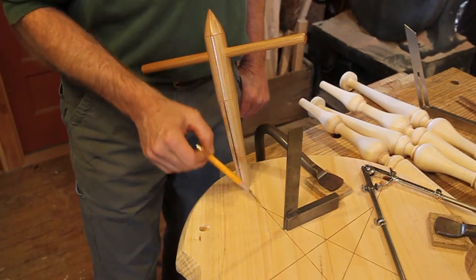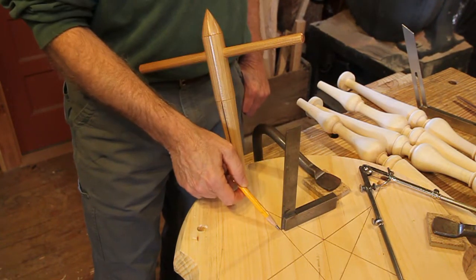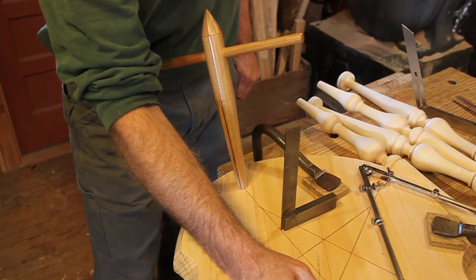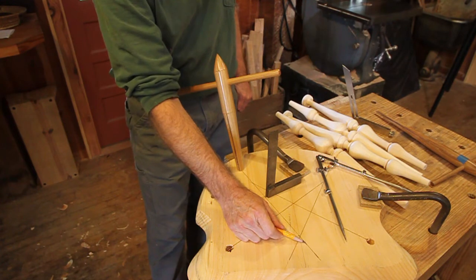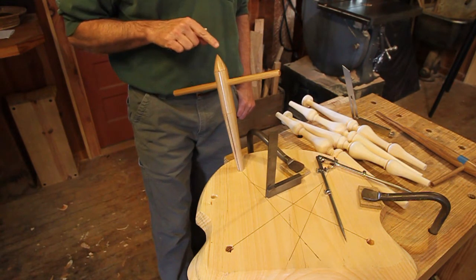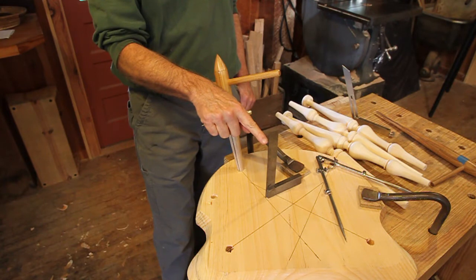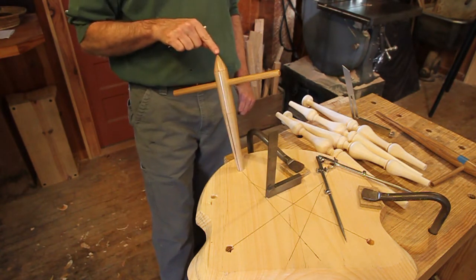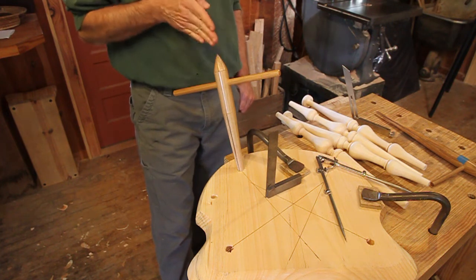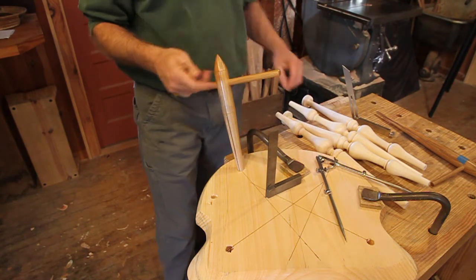So in sighting for the sighting angle here, which is what this is, I use the 3-point system. So I put a tri-square up right on the line, and there's the point on my reamer, and then there'd be a point out here along the line somewhere that you're going to use, and you line up those 3 points and you can see exactly which way that reamer needs to go. Now don't let the point on the reamer influence what you're seeing. When you look back, you're going to line up first the tri-square and this point. Then look back at this and see where it then lies along that plane. And then you'll know you've got to move to the right or you've got to move to the left. Okay, so that's the way that I'm going to be sighting the sighting angle.